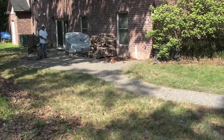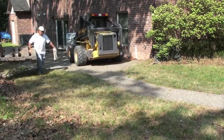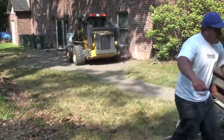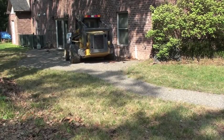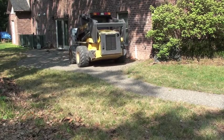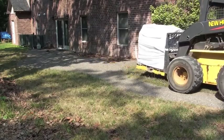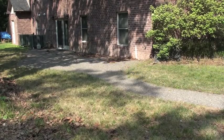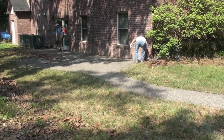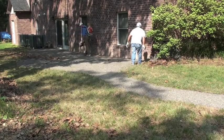So we're going to clean the area out and get everything off the patio. Once you have everything cleaned off, you are ready to start the process. Some people try to take a pressure washer to gravel lock — you do not want to do this, because all you're going to do is blow dirt and dust down into the system. The most efficient way to clean it off is to simply use a leaf blower, or a broom to sweep off any debris that's in your way.